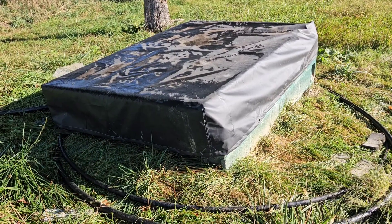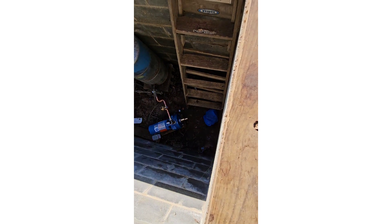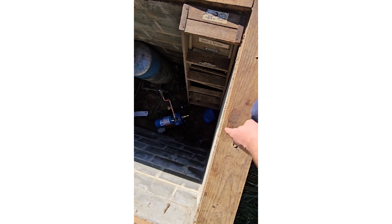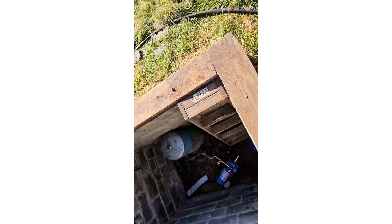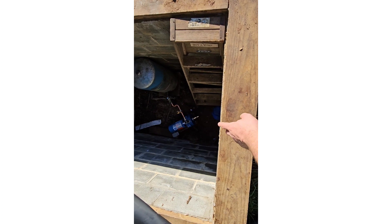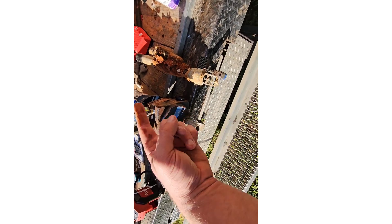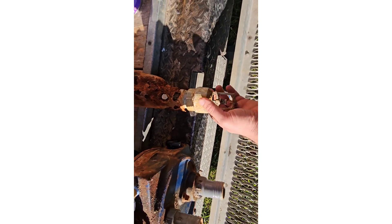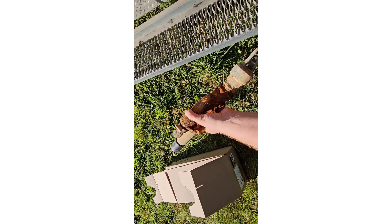There's the well in there — I have it covered up with a shoe booty. The well casing goes down probably about 30 feet and hits water around 70 to 90 feet. Here's the piping for the well. I pulled it up yesterday to replace the foot valve. It's a two-pipe system — water goes down, sucks up from the bottom, and then water pushes back down to keep circulation going. There's a foot valve at the bottom which acts like a check valve, but it was all rusted up.